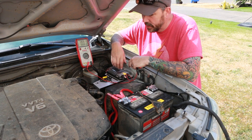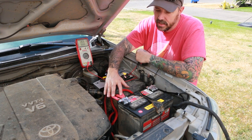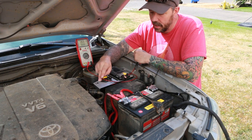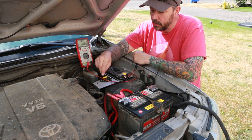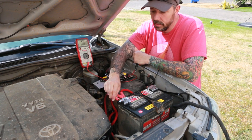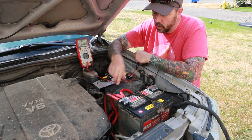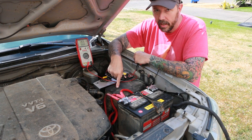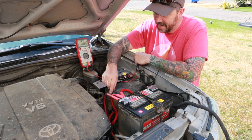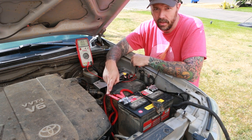The mil-spec terminals I did not fully go over — they're pretty simple to replace. The hardest part is actually your starter cable; you will have to cut that and crimp on a terminal. I went ahead and replaced my starter wire as well as the wire going to my engine compartment fuse box because I wanted a larger cable, and I wanted to extend the cable for both since I will be running a dual battery setup.